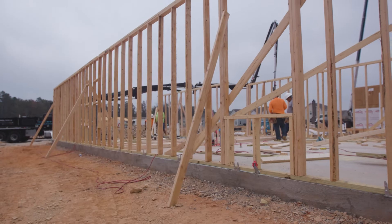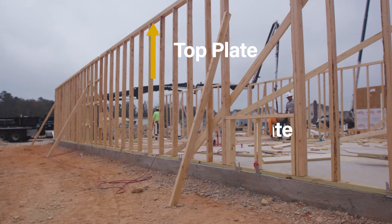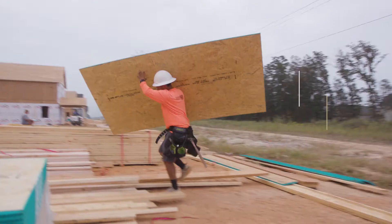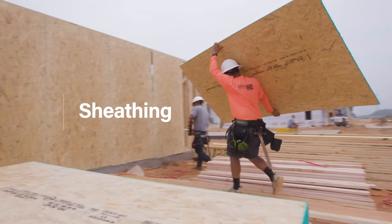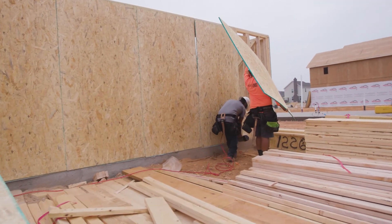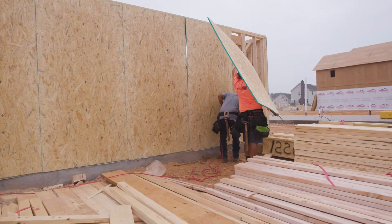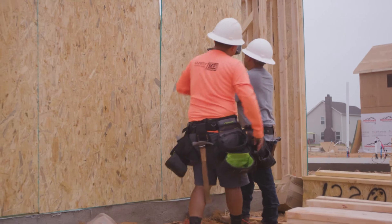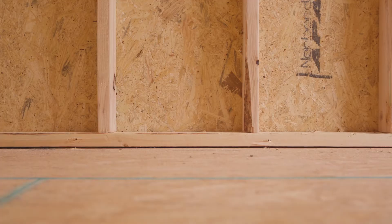Usually the standard wood framing system — meaning those containing horizontal top and bottom plates, vertical studs, and optional sheathing — work as a unit. This means all elements are necessary for the system to work. This is good to keep the size of materials manageable, but requires adaptation when large open spaces are necessary, because the usual stud spacing for wood frame structures is either 16 or 24 inches on center.